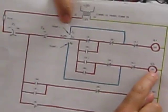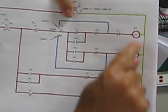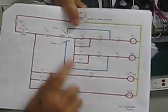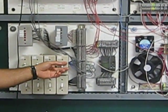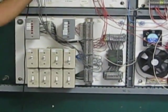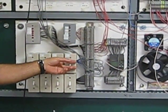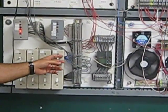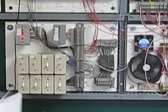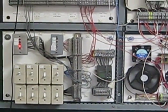The manual component bypasses the full control system, going directly to pump number one or pump number two. Now the next part — we're going to put the system in auto to alternate between pump number one and pump number two. To do that, I'll turn switch number four, which represents auto in my PLC input, and when I turn it on, pump number one should come on.